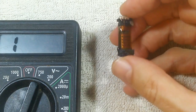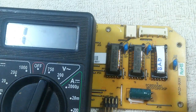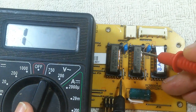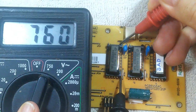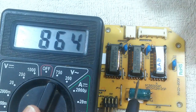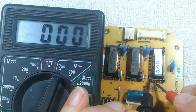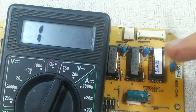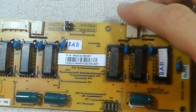Now let's measure them in circuit. Here's a good transformer: the input coil shows continuity, and the output coil measures 760 ohms — the resistance is higher because that wire is much longer and thinner. Now testing this transformer: the input shows continuity, but the output is open. So we know this one is bad. You can test these in circuit by looking for continuity on the input and output coils. The tricky part is figuring out which pins are which. In this particular case, that pin and that pin are the input, and the pin partially covered under the black plastic is pin two of the output coil.